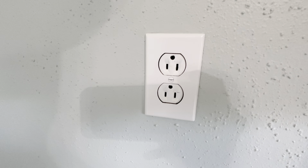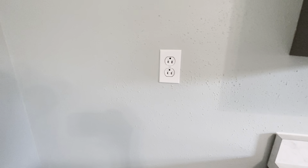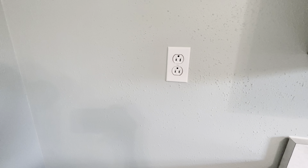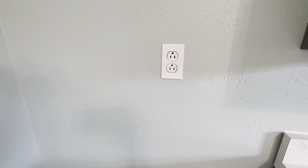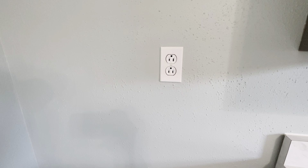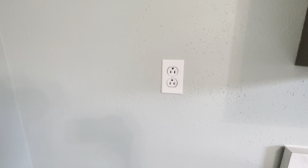That could cause a bad connection with anything you plug into it. So don't paint over your receptacles — just buy new ones. If you're wanting white or another color, just buy a white one. If you're wanting white, don't paint them white. I know you can't get blue receptacles, but you're just going to have to live with not having a blue receptacle. Please don't paint them.